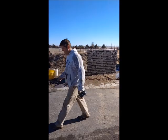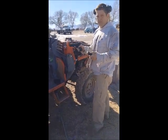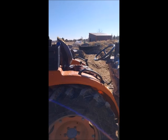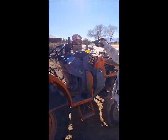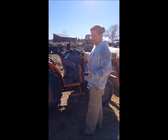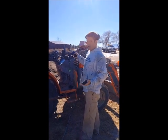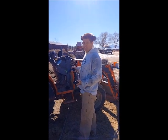To get things started we're going to use a Glock 40 — 40 caliber pistol. That's what the bullet looks like. From 40 feet away on this 14-inch thick earth block wall — this is an 8% cement-stabilized earth block wall. We don't expect to see much difference between the unstabilized and stabilized blocks. A lot of people think the cement makes the block stronger, but the blocks are strong because they're made out of dirt compressed at about 2000 psi. Whether it's 100% dirt or 92% dirt, that's what's stopping the bullet. The cement actually just makes the blocks waterproof.